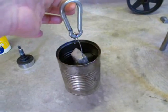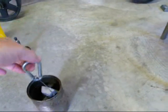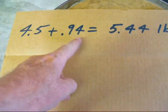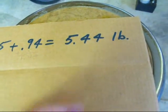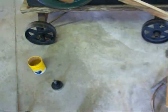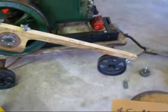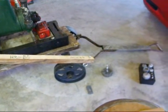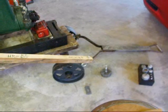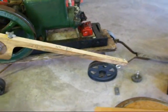I took this can and the hook in the house and weighed it, and it was exactly 4.5 pounds. So we take that 4.5 and add it together with the weight of the beam, which was 15 ounces, and that comes to about 0.94. Those two added together is a total weight of 5.44 pounds. Now the final RPM was just a little faster than the 450. I had my foot on a wire and was revving it just a little faster, trying to hold it at open throttle when I was taking that measurement, so that was determined to be 475 RPM.